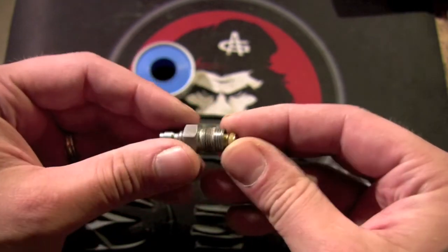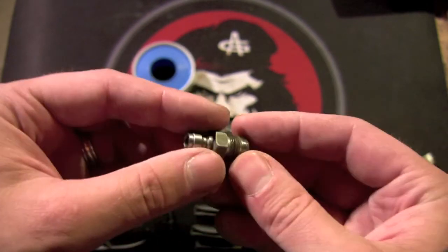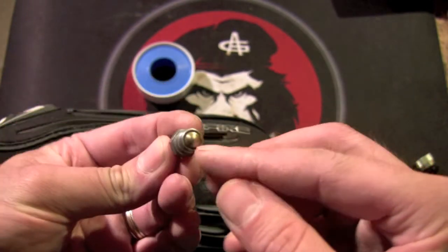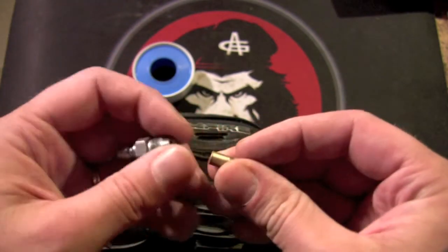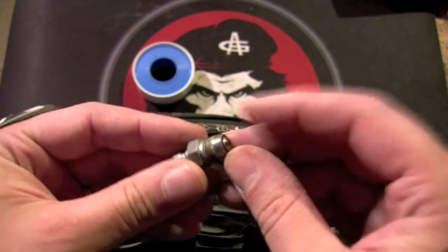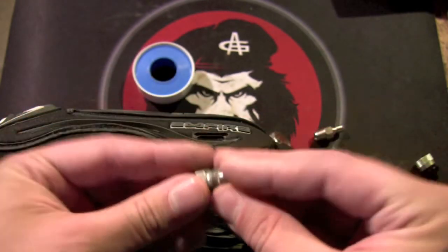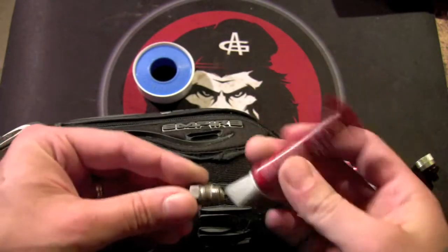And so after you've detached, or even while you're maybe gassing this off, but often once you detach, you'll hear hissing coming out the fill nipple because the pressure inside the tank is greater. It's pushing against that O-ring. That O-ring isn't sealed and it's flowing back out of the tank. So you might have to take off the fill nipple and get a new O-ring for the back of that piston, ram piston, whatever you want to call it, and put that back on your regulator, putting a little dab of blue Loctite on.